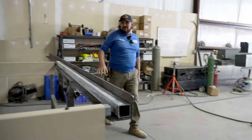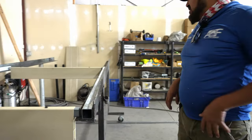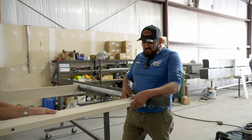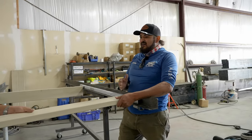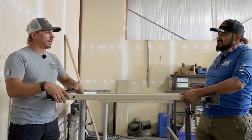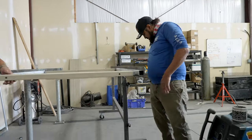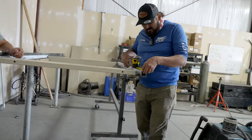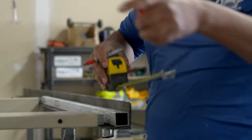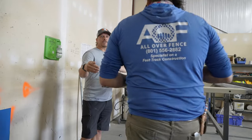This gate is a square. As long as we have this at the edge, the gate is going to be square. Anytime we have a drop, we keep the first one where it is and then adjust for the drop — whatever they requested, whether it's an inch or six inches. Once we get past five inches we're facing it and cutting it on an angle. The body height is 68 inches, so we put a one-inch mark here and match the height.